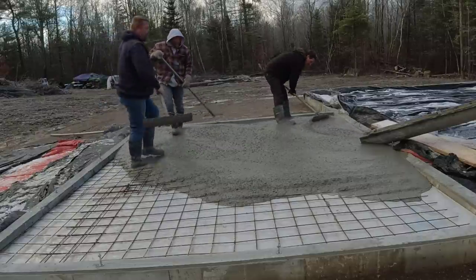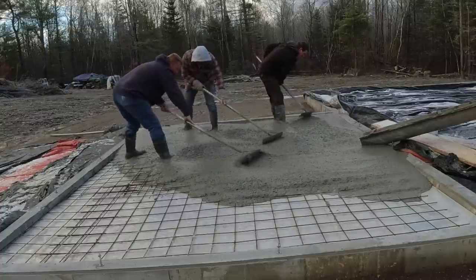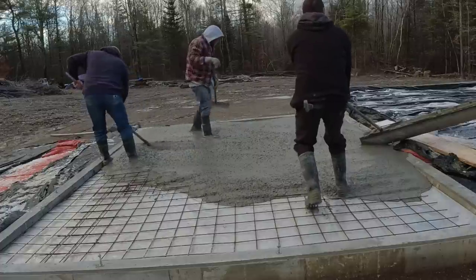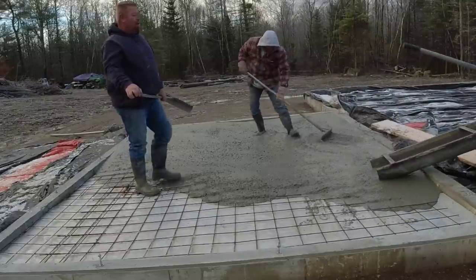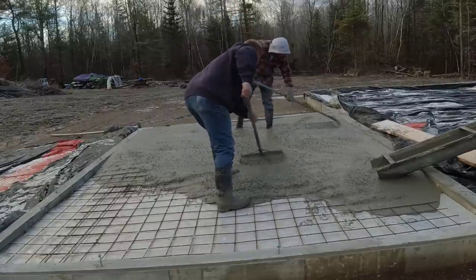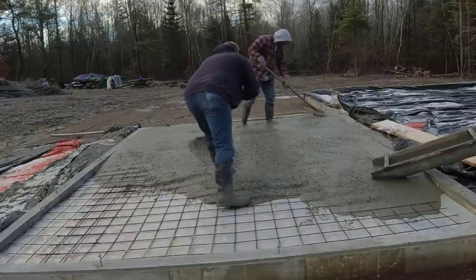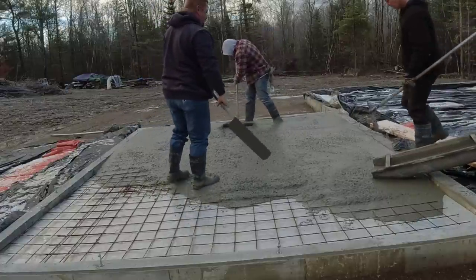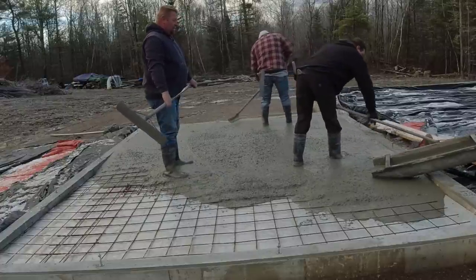We're also using 4,000 psi concrete with hot water and accelerator in the mix. We put high-range water reducer in because we had quite a long pole — a 16-foot chute attached, so the concrete had quite a bit of chute to flow down. We had to bump up the slump quite a bit so we wouldn't kill ourselves. We couldn't get the conveyor today and these two pads are kind of small to get a pump truck, so we decided to just put a little high-range in it. That's not going to affect the set times at all — it really doesn't bother the finish.